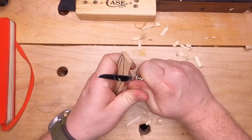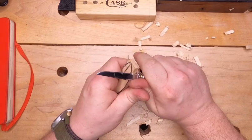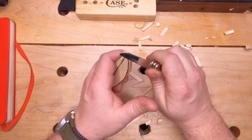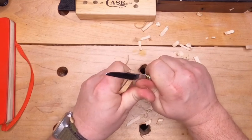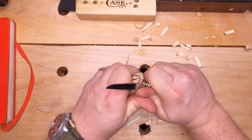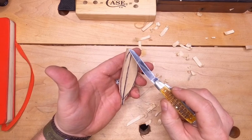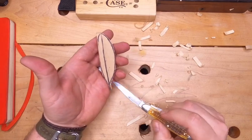We just keep working it until we're comfortable with how close it is, going to the top end. When I'm pushing through this way, I'm not turning my hand with the knife — I'm actually turning the other hand that's holding the piece, and I'm pulling it into it, just letting it take a little bit. For the moment, I'm going to leave this bit right here to give me support as we're working on the center.